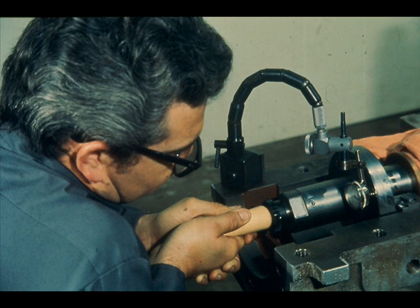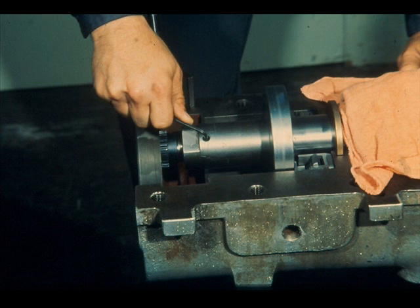Another place where runout could occur is the OD of the thrust collar locknut. The ID of the outboard oil seal ring seals on the OD of this locknut, requiring a relatively true running surface. Before the runout is checked, the set screw should be tightened as the workman is doing now. With the foot of the indicator on the locknut, one workman watches the dial while the other turns the shaft. The total indicated runout here should not exceed two thousandths of an inch. Excessive runout would indicate some deformity on the face of the locknut and would necessitate removing the nut and correcting the cause.